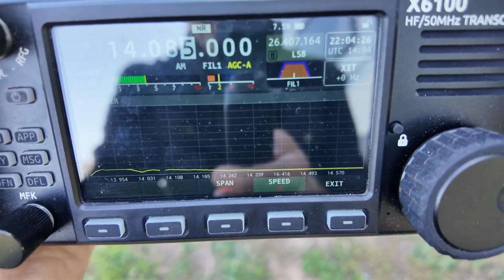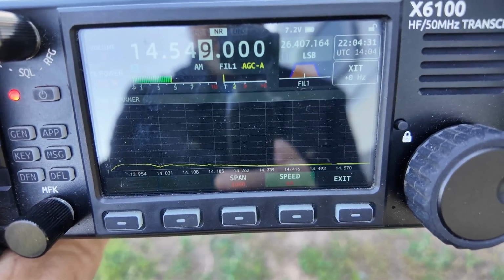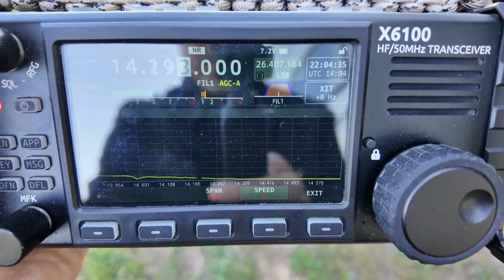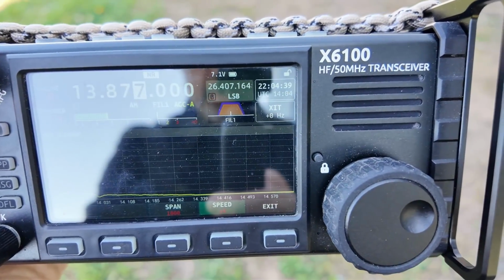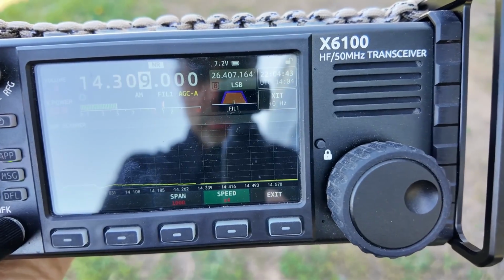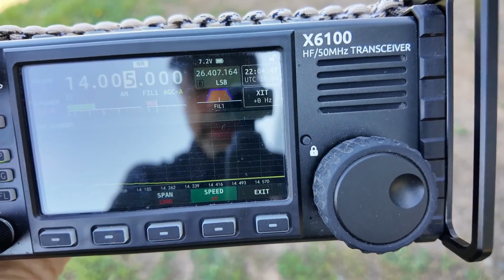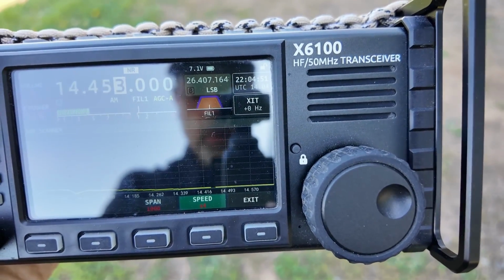All right, so the display here is graduated into 11 horizontal segments. And you can see at the beginning we're at 13.954 frequency and we're at 2 to 1. And as we go higher in frequency, we start to get really close. Right around 14,262, it dips below that 2 mark, probably 1.3 to 1 at that range. And then at 14,339, we're at 1 to 1.